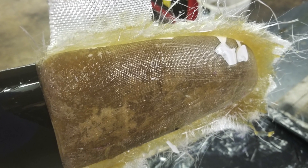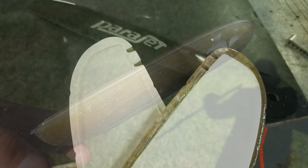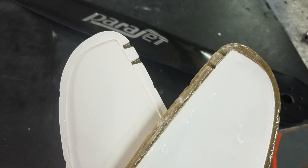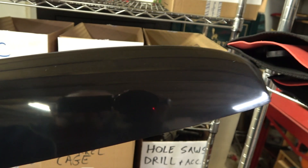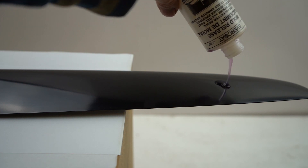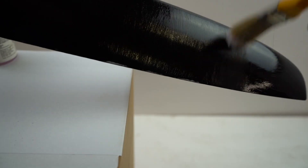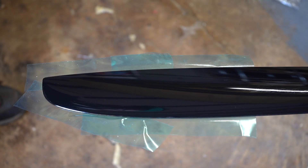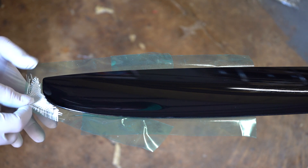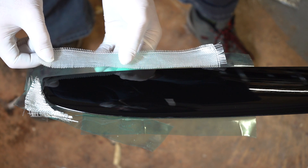These are some of my old molds. I've taken pictures over the years and made a bunch of these things. I use them for propeller tip repairs, but this is gonna be for one of the newer ones. I documented the entire process. This is an atom 80 propeller — brand spanking new. First thing you want to do is clean it really well. You don't want any dust, debris, smudges, or oils, then coat it with PVA mold release. This stuff dries into a very thin film — you can't even see it — and then I'm gonna start building up my layers of fiberglass and epoxy resin.